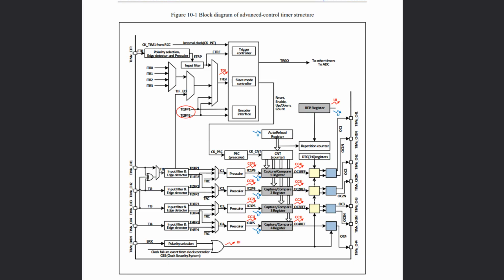Very simplified, a hardware timer is a specialized part of the circuit that is inside our MCU, and its sole purpose is to count clock signals. When the current clock count reaches a certain value, it does something, such as triggering an interrupt that will run our predefined function.